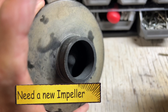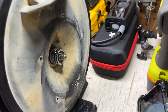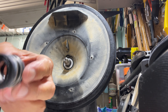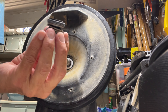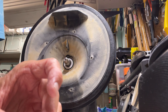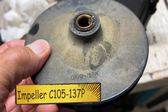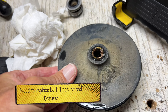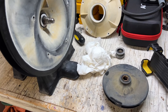I think this impeller is not looking good either — I need a new impeller and a new diffuser. The impeller part number is C15137P, and you can see it's pretty worked. I think I want to get a new one of those, and a new diffuser too — look at that, that's a mess. If I'm going to rebuild this I might as well rebuild it right since I've got a brand new motor. Let's not go half-assed.